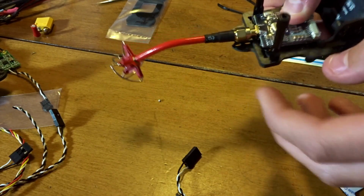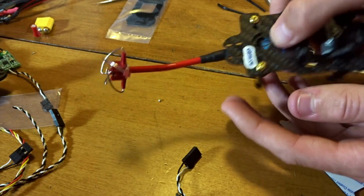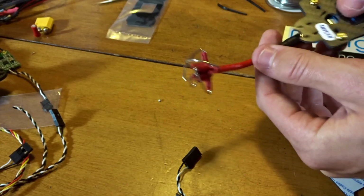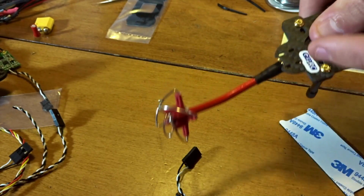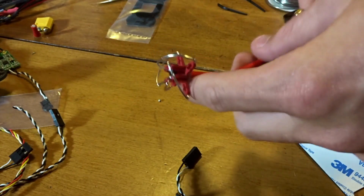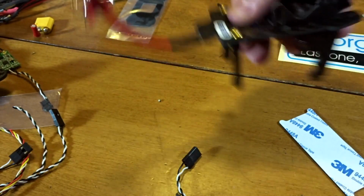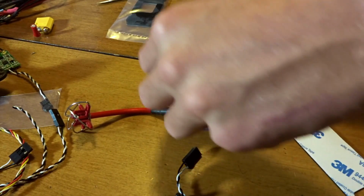Hopefully angle it just a little bit because this plate is offset, if you can see that, but this video transmitter has a central antenna instead of an offset one, so it's working against us. But if we put it a little bit to the side, we'll be able to wrap around the connector and the antenna, and it'll be a really nice, strong, clean, out the back, up antenna like that. So let's get some more foam tape and put that on these parts here.